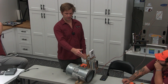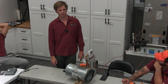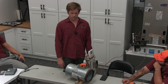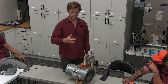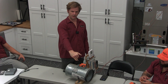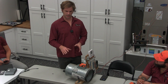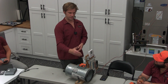The newer ones have an arrow on top to actually show you the direction of your damper — super convenient. The older ones don't have any of that, so you have to open one side and look at it when doing the setup on a new motor. Knowing that they spin 45 degrees to close, you can also by hand feel where it's hitting, and you know that's your stopping point. Go from there all the way to the other stopping point. Mark where both of the closing points are, and the center of that is your open point.